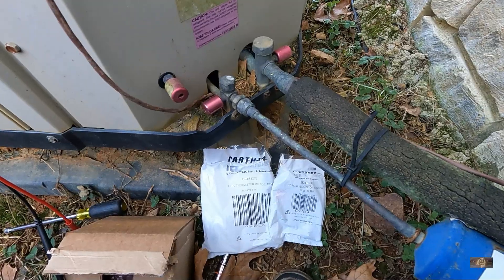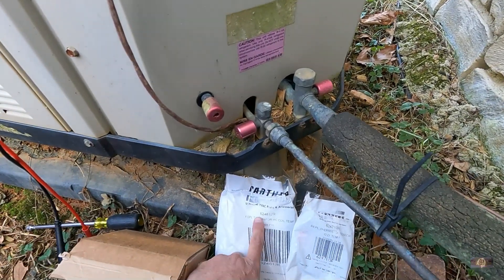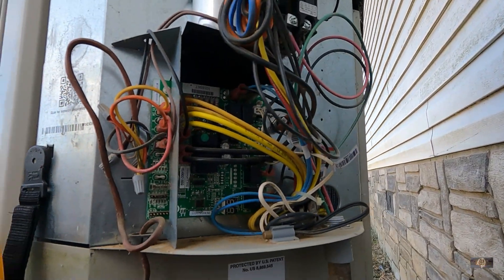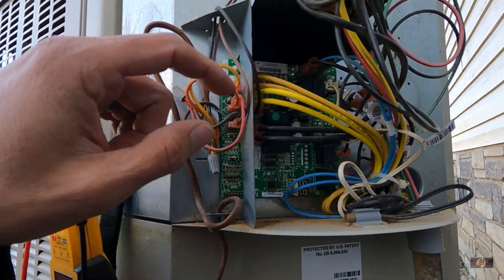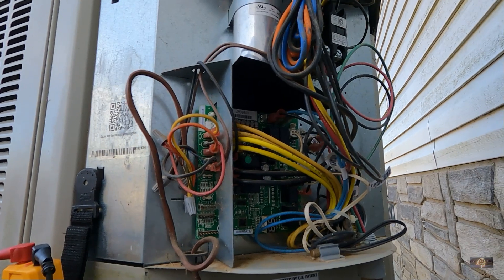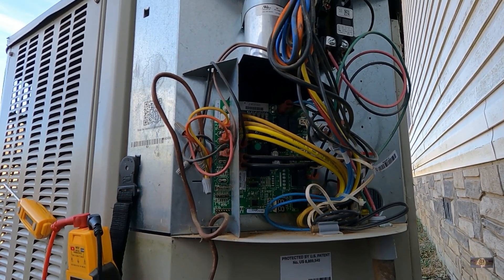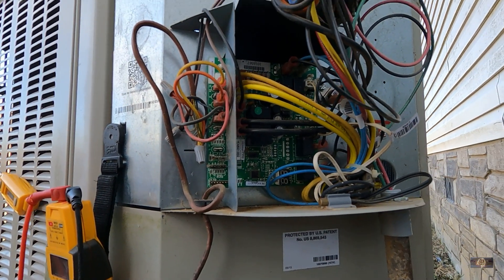I'm back. It's pretty windy out here — it is wide open. I got the thermistor coil temp sensor, the outdoor ambient temperature sensor thermistor, and the new board. I went ahead and killed power at the disconnect and also shut off the breakers for the indoor unit — there were two of them. It's got a 15 kW heat kit, on a 60 and a 30. I tested voltage: my high voltage is dead, and between R and C it's dead as well. I'm going to go ahead and start swapping this board out. I'll pull my sensors off and put the new ones on. Before I put them on, I'm going to do an ohm test to make sure they're reading okay. I'm going to keep the defrost termination set point at 70 on the new board.